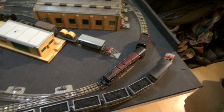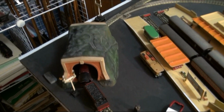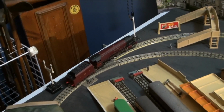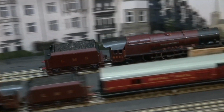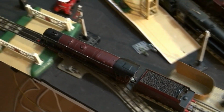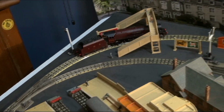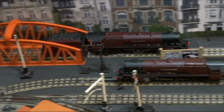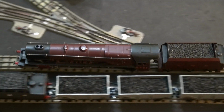And it's not exactly flying, but it's going. I don't know whether you can see. Let's see if we can see down the back there. There does seem to be some sparking where the back centre rail pickup is. That's maybe the centre rail pickup's not pressing very well down on the centre rail, so we're getting sparks jumping across. I don't know whether you can really see that on the camera, but otherwise, it sort of goes, but not too thrilling.